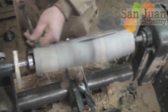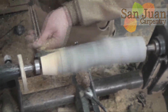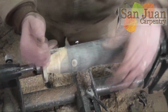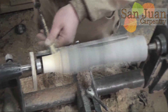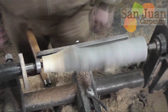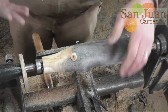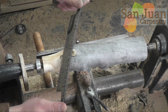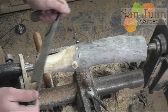Reset your support bar, get it moving. You can see the table is vibrating a little bit because it's kind of a wobbly log. Anytime you have a log with big knots or some shape to it, you're going to get a lot of vibration. You can see now an aerial view of how I'm shaping it. That pattern actually leaves a little crease in the tenon so you can see, when you turn it back on again to carve more, where to start from — you just carve behind that line. What we're doing here is gradually carving away that log, and what that's going to do is make it look like we're carving it with the blade. A nice gradual shape.